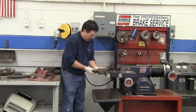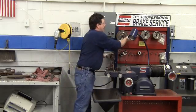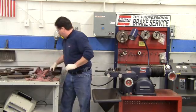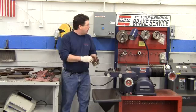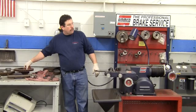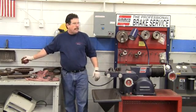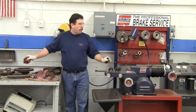We don't have time to machine that one. Once again, your adapters and all your stuff gets hung up here. There's probably going to be some grease left on here — if there is, wipe it off and clean it off the adapters. Before you install this back in the vehicle, wipe out any dirt and grease inside, because metal shavings will get inside and stick to the film of grease. If you don't clean it out, those shavings will cause the wheel bearings to fail.